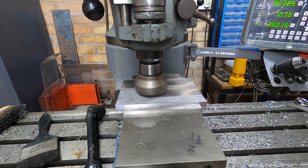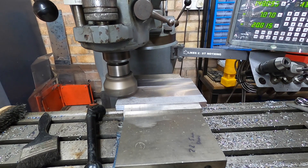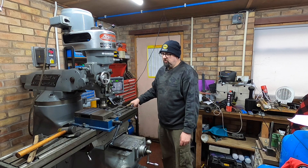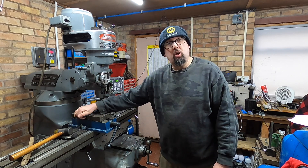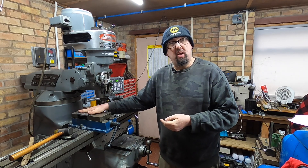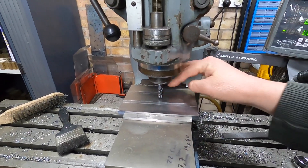There's no ridge there at all, so we're all good. So that's both of them now machined on both sides. I've taken off probably at the most 0.75 of a mil. We've now got it totally flat. We are set up — I've found the centre of the plate, I've put the 10mm cutter in. This is now the middle. I've done a few calculations in my head and I've worked out where I want these little pockets, so I'm going to put those in now.